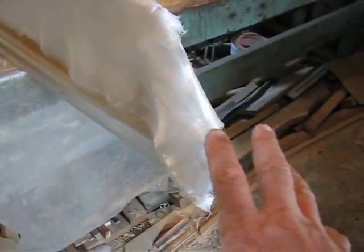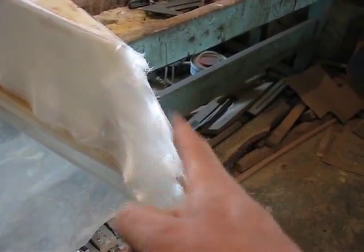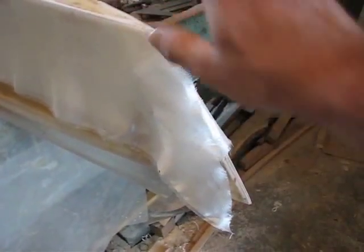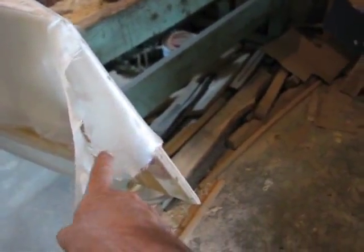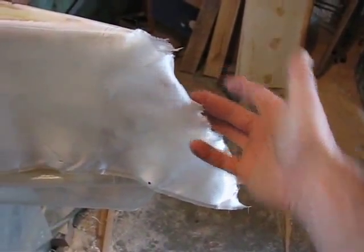Okay, so in episode 1 I showed how I did this bow only with thickened epoxy on the inside and no fiberglass inside. So basically now it gets two layers of glass outside on the whole bow, and if a little bit of glass is missing then I will add on a little piece. So yeah, I cut this little bit overhanging, then I cut it down the middle up to here. And now I'll wet out the boat, glue it on, and then this one overlaps it like that, just a little bit. There's a small overlap over here and it's enough. And there you go.